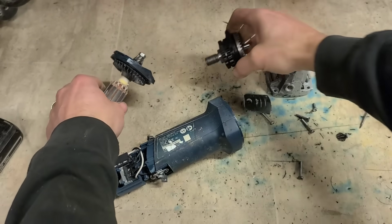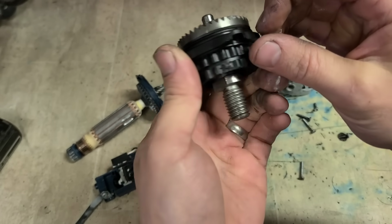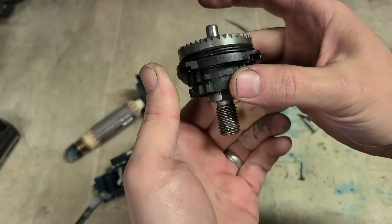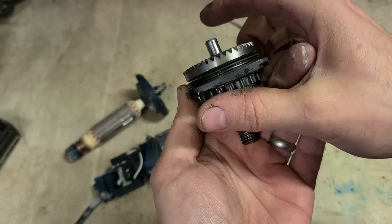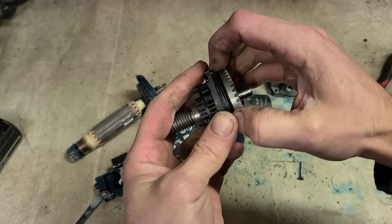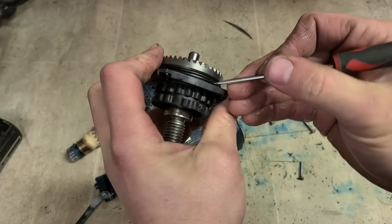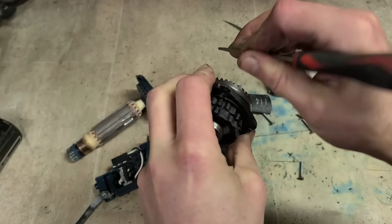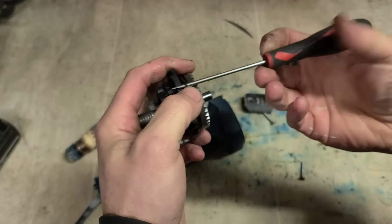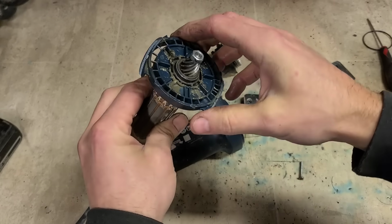That one might be going bad. Could be this, just this seal got a pinch or nipped or worn. Mind you, it doesn't look like it. There's a wee bit of a twist on it there, mind you. A little bit of a flat spot. That's the only thing keeping the grease on, so unless it's that, we'll just replace that as well. But that's all I can see. Head off, replace it, and we'll change this bearing.